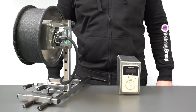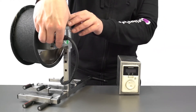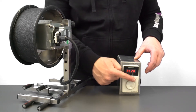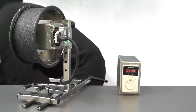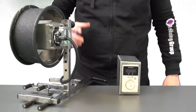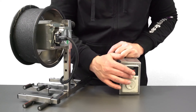Due to situations on the jobsite, a loose or improperly connected cable can occur. When this plug gets loosened or disconnected, the pullback unit stops and it shows you an error code on the screen. In this case, switch off the control unit and unplug the whole system from the electric power supply. Wait until the screen extinguishes. Plug back and firmly secure the connector. Reconnect it to the electric power supply. Reset your pullback frequency and spray on.